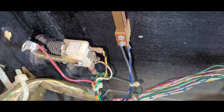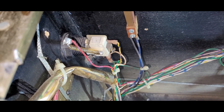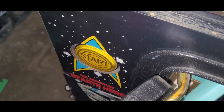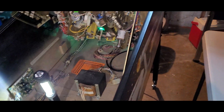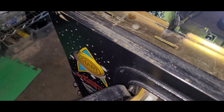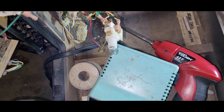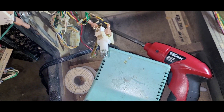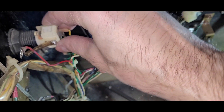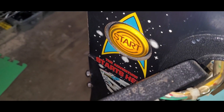Ouch — okay, that didn't actually hurt, it just scared me. I just elbowed the reset arm for the drop target bank. Let's turn this on and see if we've got light. No, we do not — unless we need a second. So I have to try and wrench that thing out. I managed to pop it out without breaking anything. Put in a new bulb — there we go, that's better. Let's hope it goes back in without any issue. First time seeing the start button lit up.